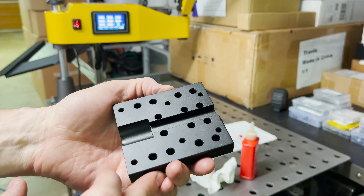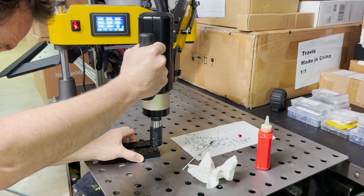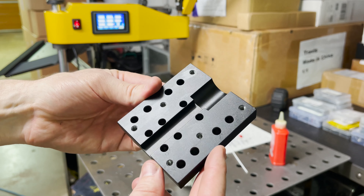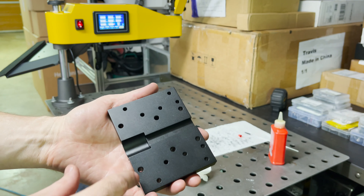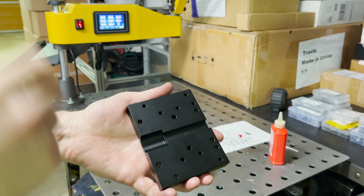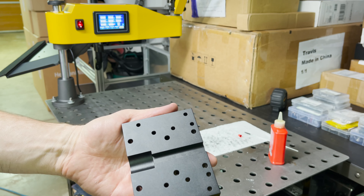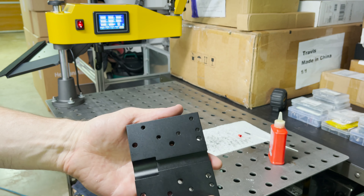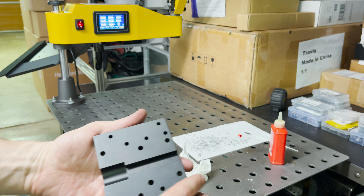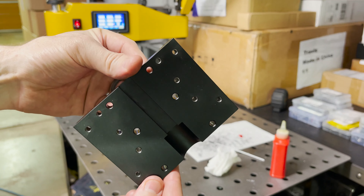This piece needs six M5 holes — here, here, here, here, here, here. That piece should be ready to go. This final piece has a couple different sets of holes: one set for mounting the manual focus BT-210 head, and the other for the autofocus head. So I have these six for the manual focus and these four for the autofocus. I'll tap those out M5s. Those are all done.